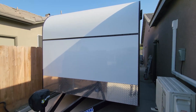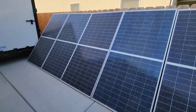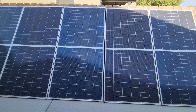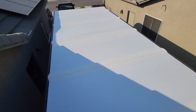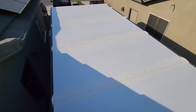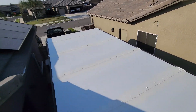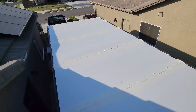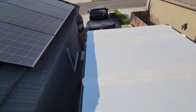I'm able to get six of the 390-watt bi-facial panels up there. These are the six Canadian Solar 390-watt bi-facial panels that will be going on top of the trailer. I also have four more 440-watt panels, but I didn't have enough of those, so these should fit the bill nicely. On the roof, we have inch-and-a-half square tube going width-wise. We're going to lay unistrut in two lines down the length for all the panels to sit on, then use panel clamps to keep them down. At the very front we'll pop a cable gland through.